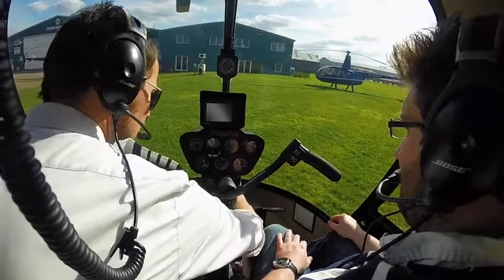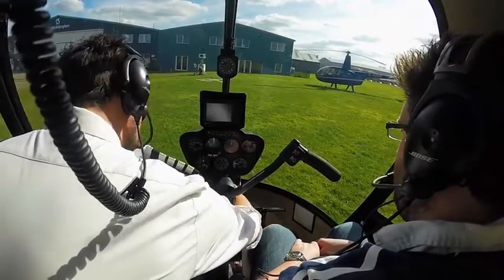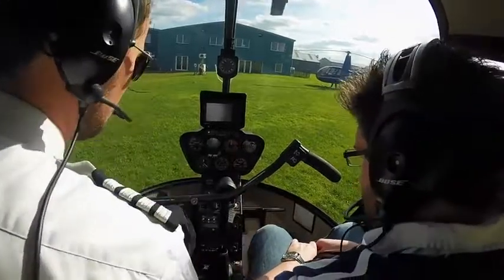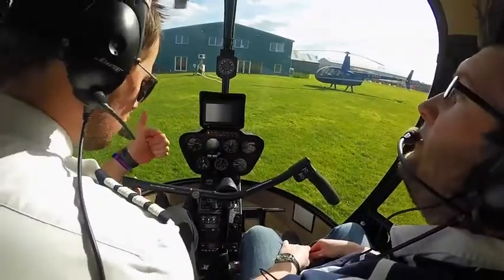She's alive! So I'm going to wait. Engine RPM looks good, between 50 and 60% — engage the clutch, engage the alternator. Clutch light comes on immediately, blades are turning within 5 seconds.